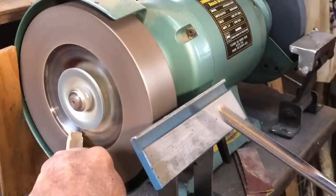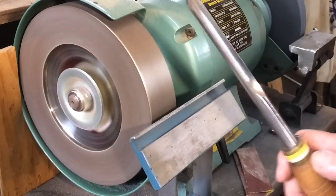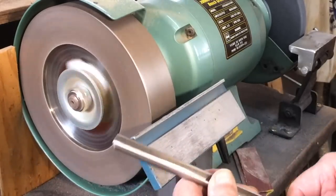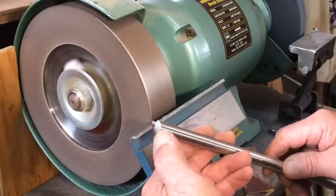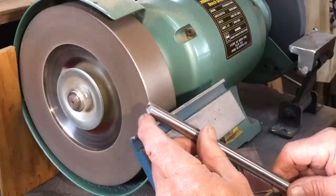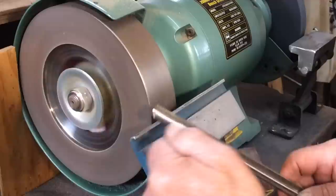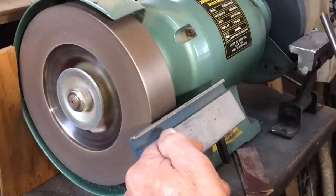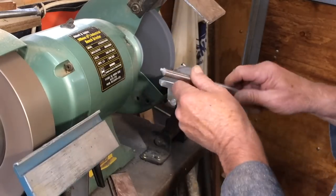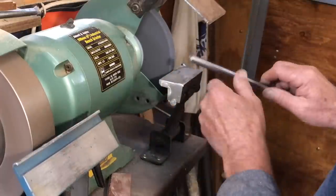There is another video on sharpening this gouge — how to sharpen a spindle gouge — so I'd recommend you to that. Then, to cope with shaping the deep-fluted bowl gouge: I want a longer bevel on the nose, but I want to keep the right wing fairly steep and I'm going to bring back the left wing. Again, I go over to the coarser wheel for that. Now I can develop the basic fingernail grind with the tool flat on the rest — just bring it around.